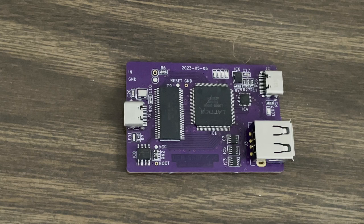I wanted to explain the ports. On the left side, there's a single USB-C port — that's the port you plug into the computer doing the capture. On the right, there's a USB-C port and a USB-A port, which is essentially a pass-through. You'd connect the USB-C port to an A port on the host computer you're capturing, and then plug the device you're capturing into the A port on the capture device. The cool thing is that means you can capture USB traffic of a completely different computer or device — like a classic Mac or a Windows 98 computer — even though they can't run the actual capture software with Wireshark. That's what's really cool about devices like this and the Beagle: they're way more flexible than just Wireshark doing USB PCAP.